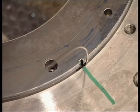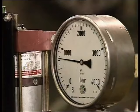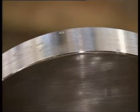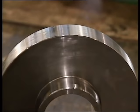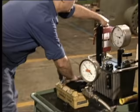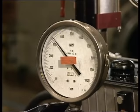The thrust-bearing collar is force-fitted on the compressor rotor. The fixture used for force-fitting the collar consists of two hydraulic pumps, two flexible pipes with respective fittings, and the actual fixture for pushing the collar into position. A high-pressure pump and a low-pressure pump are used. The high-pressure one widens the inner diameter of the collar, and the low-pressure one pushes the collar into position. By using both pumps, the collar is fitted in the right position with respect to the rotor.